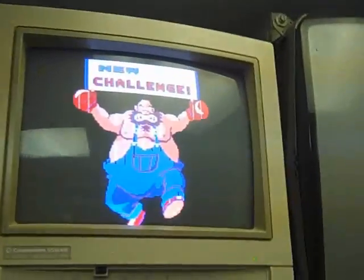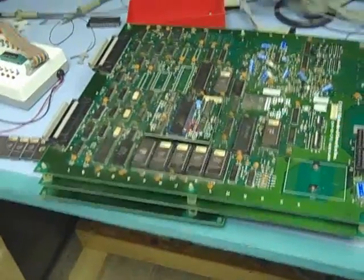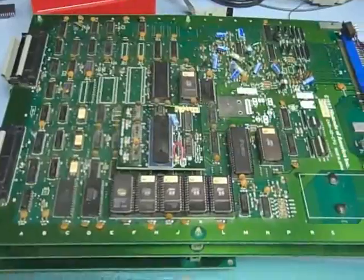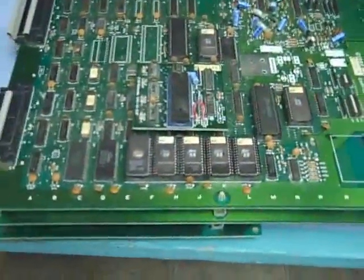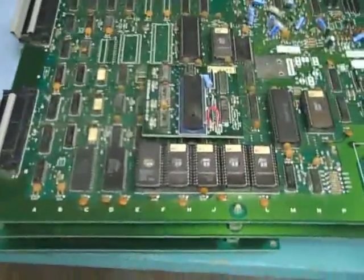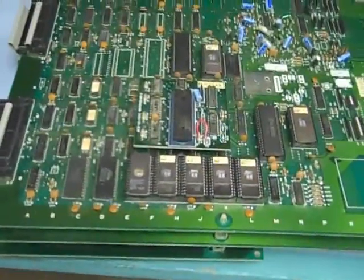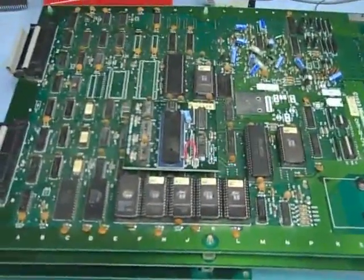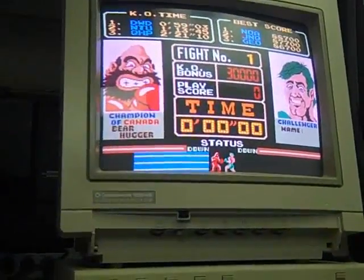We're a little bit closer — I got the game to boot and there are some graphics glitches. What I found was the DMA circuitry was actually fine, the RAM checks were fine, but the ROMs were completely off — every single one was wrong. When I did my signature checks with the Fluke I would get a different signature every time, almost like some bits inside the ROMs would return a 1 on one read and a 0 on the next read of the same address. I've never had a case where there was a bad set of ROMs but the watchdog wasn't barking — this is the main program ROM, and usually if that's screwed up the program gets lost in the weeds and the watchdog starts barking, but that obviously wasn't the case here.